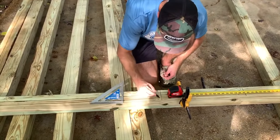So what I'm gonna show here is the installation of the first shingle in one of the rows towards the top of the shed, and it's just more of the same. We're gonna position it so we have the 1/4 inch overhang over the rake drip edge, and we're just gonna lower that shingle in place so that it's in line with the top of the wide cutout of the shingle below, and then it's just as simple as nailing it in place, just like we've done. Here I am showing the overhang that we're maintaining.